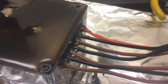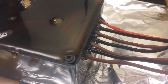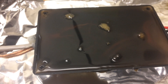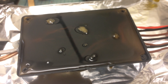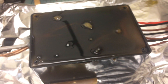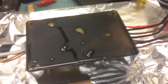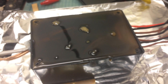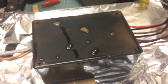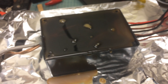I also sealed it over here so that the wax doesn't leak out. I put the screws in on the four corners so that the wax doesn't fill the screw holes and make them hard to put in. The wax should cover all the wires. Pour all the wax in at once instead of in layers, because layers can solidify with cracks between them that could let water in. Then just wait for it to cool.